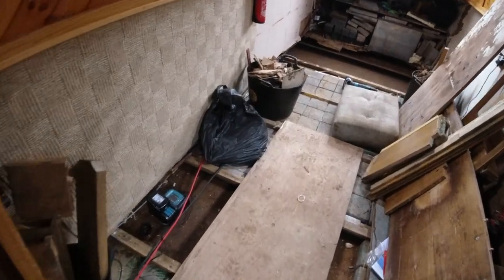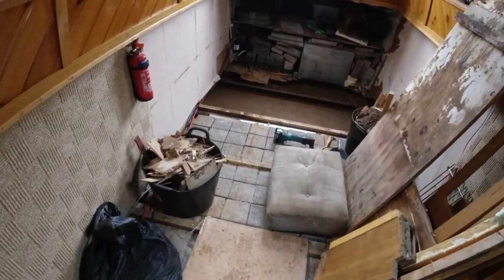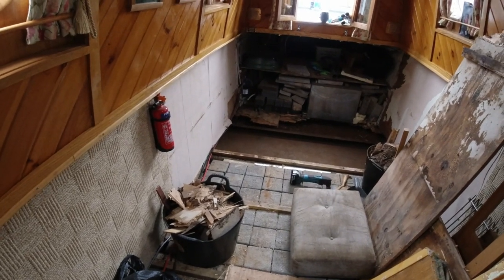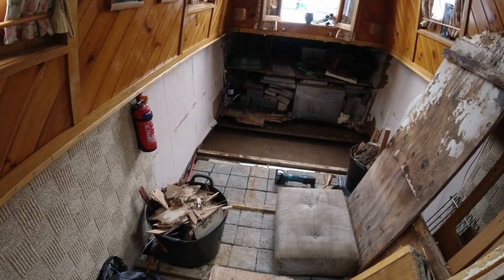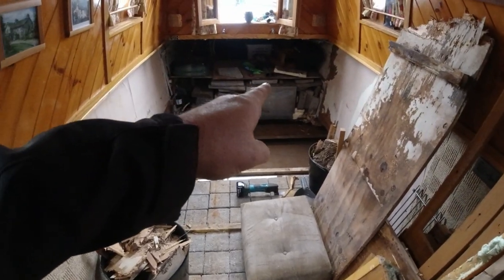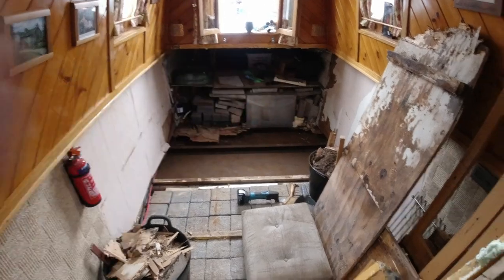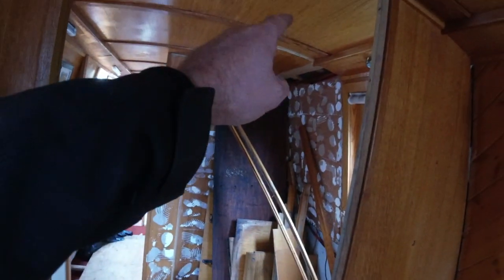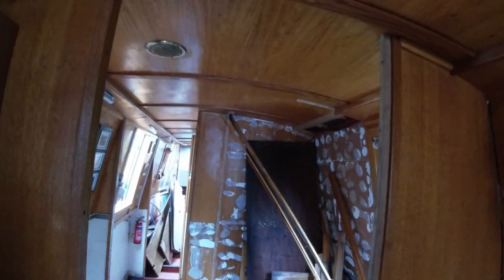And what I'll do is I'll wire them in to the engine switch somehow, or have a separate switch, one or the other, so that when I've got the engine running, the fans under the bilge are constantly running all the time. As I say, they'll suck air from the front under the tug deck, draw it all the way through the bilge, a constant flow of air bringing out in the bathroom, and then that'll go out through the extractor fan above the shower.